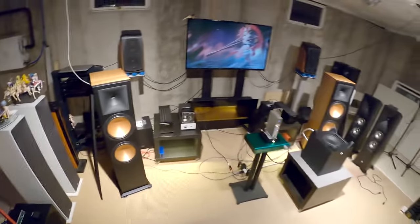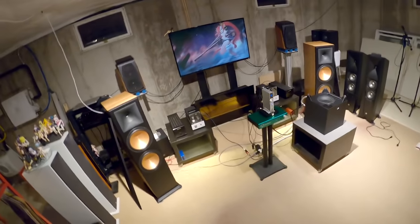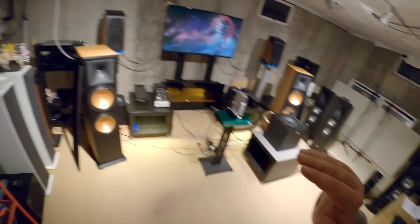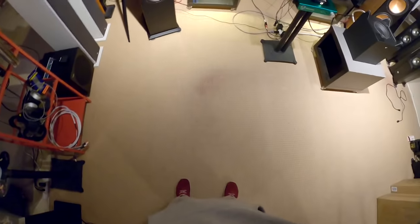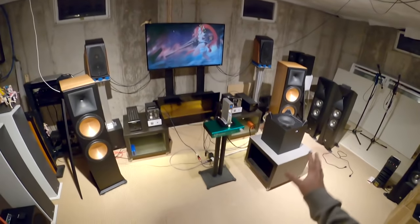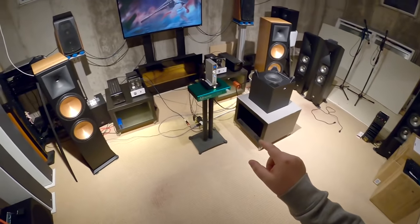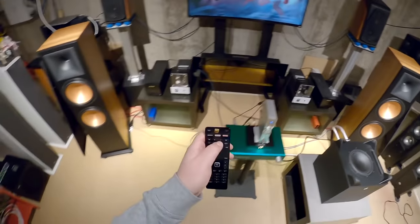Oh, the orientation of subwoofers. Does downfiring versus side firing versus back firing versus front firing matter? I think sometimes it does. Most people will tell you no. The problem comes at around 75 to 80 hertz. Anything below that, you shouldn't be able to tell where your sub is in the room. It should just disappear. But you get past 80 hertz, and all of a sudden you can sort of hear where it's coming from. And when it does that, a front firing becomes blatant. A down firing, like this is, is a little less blatant, because it's spreading out between the four feet in all directions.